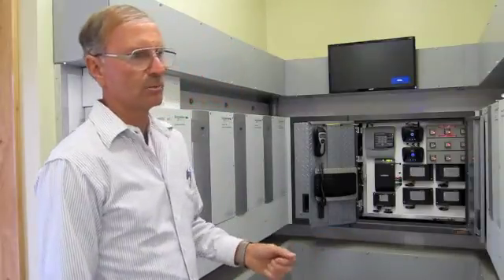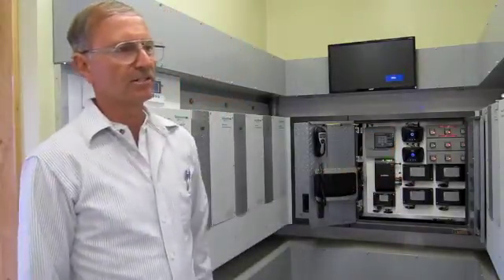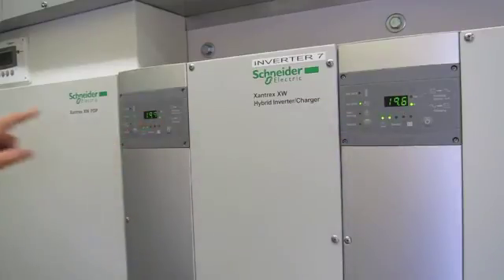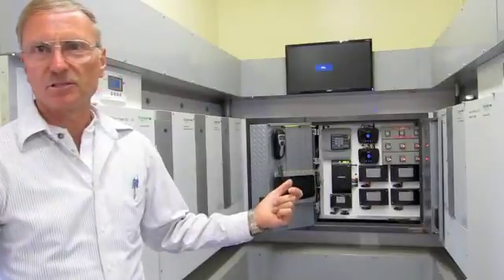Now the next thing we're going to wait for briefly is — while that generator's on — it's going to take advantage of that power and charge the batteries. I'm just waiting for it to synchronize; it takes about a minute. After a short synchronization period, every one of these inverters is producing the same amount of power to charge the batteries, while at the same time actually running the loads. Now we're going to simulate the problem being corrected and restored. It takes about 10 to 15 seconds, and that was the most amount of time you'd possibly have to wait for the system to correct itself and go back on. We're pretty happy with that.